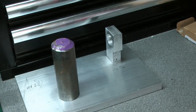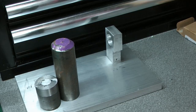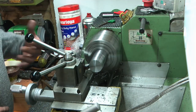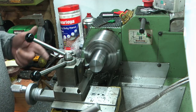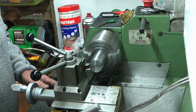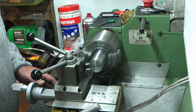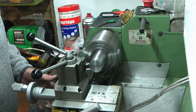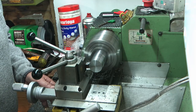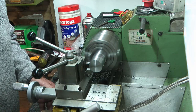I'm going to carry on with the cylinder. I've taken one of my chunks, faced it off and cut off the bit that's not wanted. I'm going to turn this - the crank end, not the head end. It needs to be 1.125 diameter over a length of an inch, 60 thou out. So I'm going to turn it to about 20 thou out over diameter, and only back about an inch for now - roughing out, using the power feed and DRO. Taking about a mil and a half a side, about 60 thou a side off. Just trundling along, not overworking it.